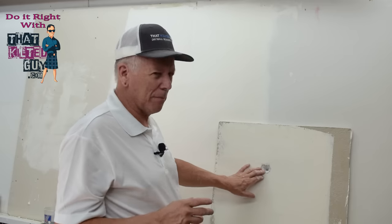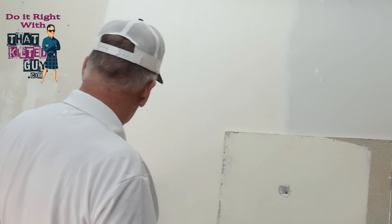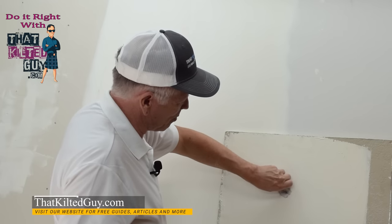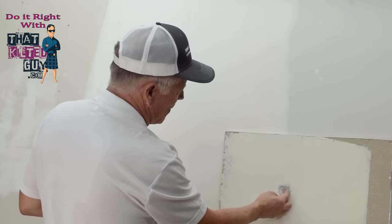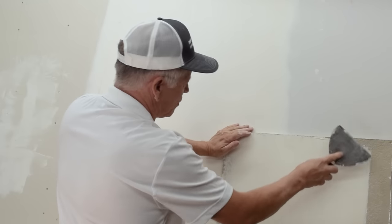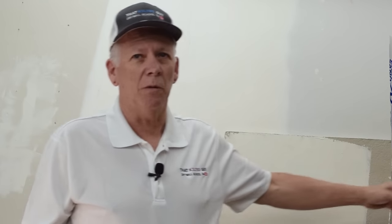This will actually put it back to be pretty strong. What we're going to do is start by making sure you clean up anything that's loose and dangling. You don't want any loose paper or chunks of drywall — it should be swept out like this. If you find any really loose stuff, go ahead and pull it out. Then you've got a nice clean surface. Start by scraping to make sure there are no ridges or anything sticking out.